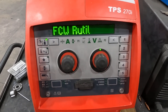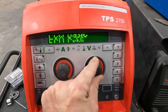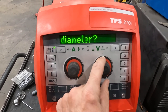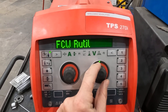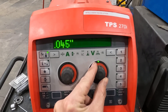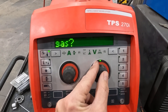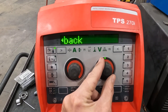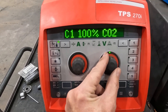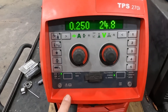You've got options here to select your filler material. Click this button and it jumps you through a ton of stuff. I'm on flux core like I mentioned, so I select that, then hit my diameter — I only have 0.035 and 0.045 options here — then gas options. Since it's gas-shielded flux core you really only have a couple options: a mixed gas option and a 100% CO2 option. I'm running mixed gas on this particular one.